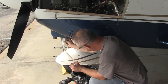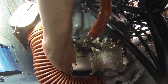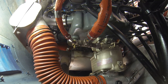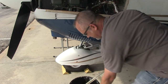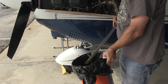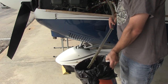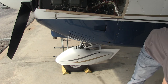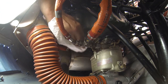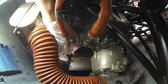Now we're going to remove our drain tubing, pull it out of the bottom of the cowling and go store it somewhere clean. We recycle the oil — there's a nice recycle bin here at the airport. Always ask around and don't just dump it somewhere. Be environmentally friendly and properly dispose of the oil. We're double-checking that our drain port is in the locked or closed position, and we're going to start adding oil.